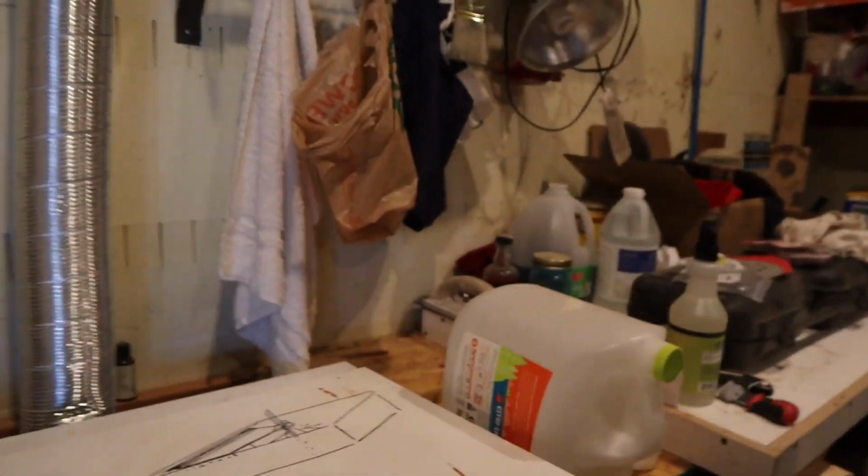And then how does it get bolted to the floor? You drill a hole into the concrete, because underneath where the staircase is, there's a 12-inch thick piece of concrete. So it's actually 16 inches thick right there, because of the floor plus 12 inches of concrete underneath. There's a 2-by-2-foot pad under there, and then it'll get bolted into that. I'll just drill a hole all the way down. And the radiant heat goes around that 2-foot square pad.